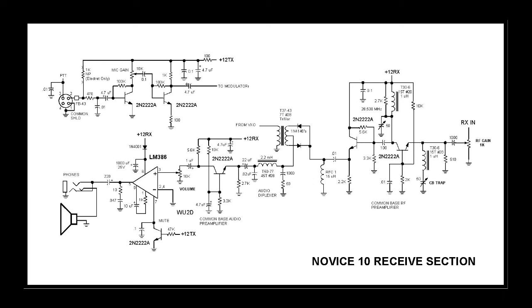As I said earlier in some of the other videos, these are preliminary schematics. Those circuits that you find in the textbook, online, in blogs, and even expertly engineered and modeled circuits are only deemed good when they're actually tested and proven circuits, and that takes time. There's almost always surprises when you build something. The mic amp was tested. That's a tried and true circuit, and I'm happy with it. I stated before I wanted the receiver to have the benefit of an RF low-pass filter, so that meant that the output filter had to be in between the antenna connector and the common terminal on that relay.